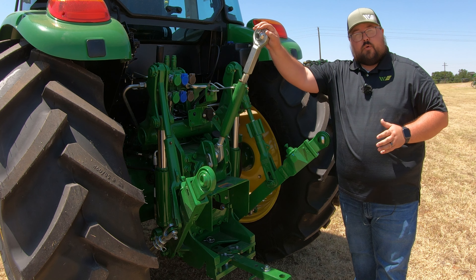Another thing about service points: back here at the rear, you are going to require quite a bit of grease. The three-point is going to have grease points everywhere it pivots — on your actual link arms, on your raise and lower cylinders, on your rock shaft up at the top, and at your pivot points at the bottom where the three-point arms connect. Make sure that whenever we are servicing this machine, we spend time back here getting everything greased up so we don't have problems in the field. Also, don't forget your windshield washer fluid tank right up here on the right-hand side bolted to the fender — keep this full so you can stay clear on the windshield.